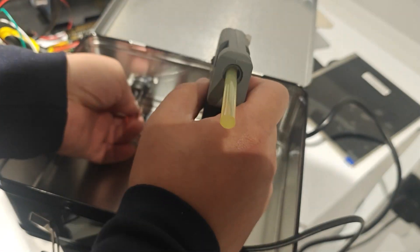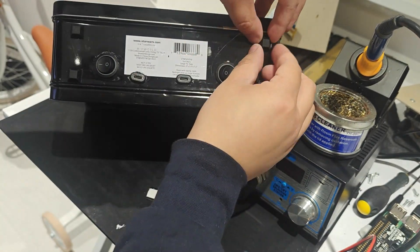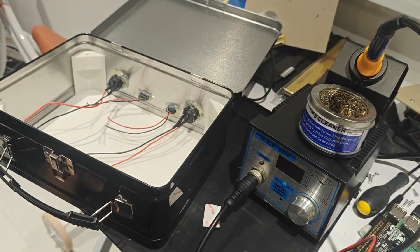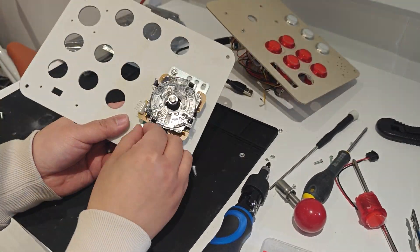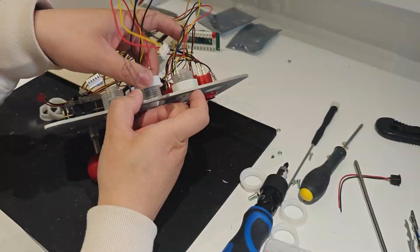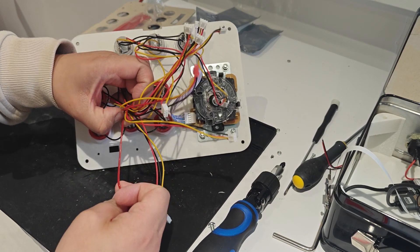As you can see here, I did have to use hot glue so the parts wouldn't move. It's definitely not a clean finish but it would be covered up so no one would see it anyway. I bought these rubber stick-on feet to give it a bit of space between the switches and the bottom of the lunchbox so it doesn't actually switch the switches. The next part is the rough assembly — just make sure all the inner parts go in fine and I have enough space to fit and close the lid. There was one thing I missed on the top cover: a small cutout for the screen's ribbon cable to go through. A quick file will suffice. Once done, a quick primer. Now to remove all the parts and transfer them over to the 3D printed part. Once all that is done, I zip tie the cables so there is some neatness.